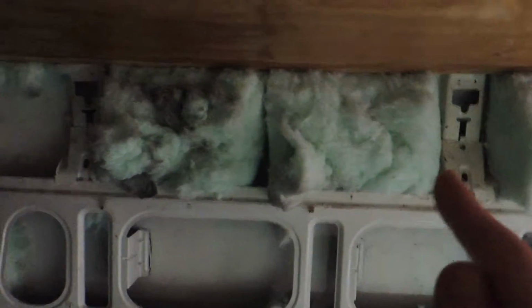It's just spray foam there, then you cut it, and then you put the new bit of wood over the top. I'm going on a bit of a tangent here when I only came out to explain a window, but this section here goes back quite deep, and I was thinking, do half of it with the spray foam insulation, and then build a cupboard into the other half. It comes out to about here, and it's a bit deeper than it would usually be if we'd just retained the original walls.